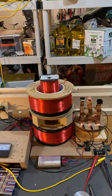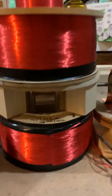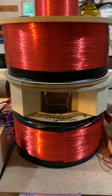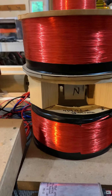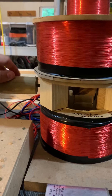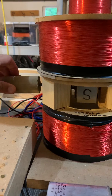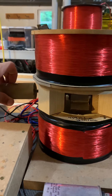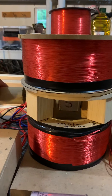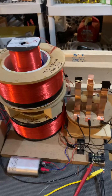The more wire you have, more turns, the stronger the magnetic field. Inside here you've got some magnets rotating south-north. When the commutator engages — right about this point — it creates a magnetic field that aligns the rotor. Then the contacts break, momentum carries it around, and it reconnects backwards, sending current backwards through the coil, pulling the rotor in the opposite orientation, and it continues on over and over. Simple design.